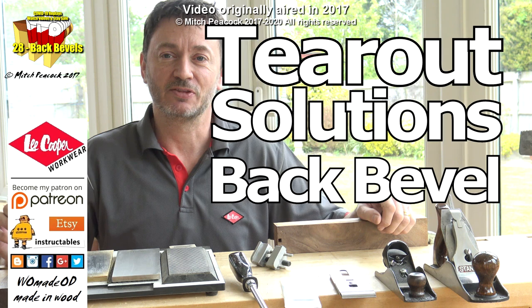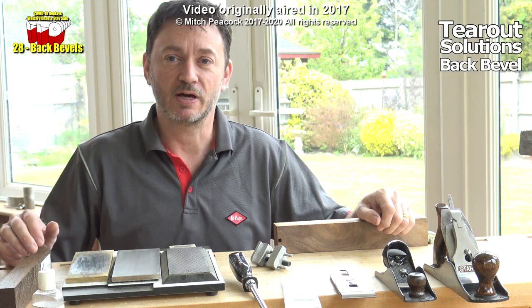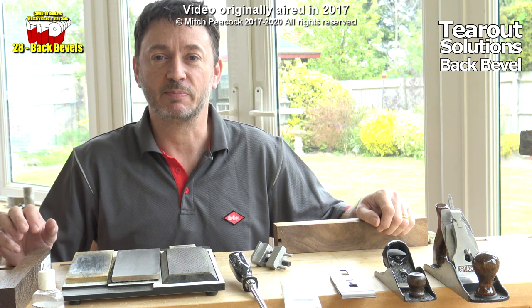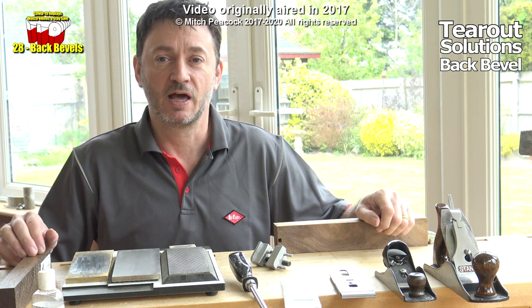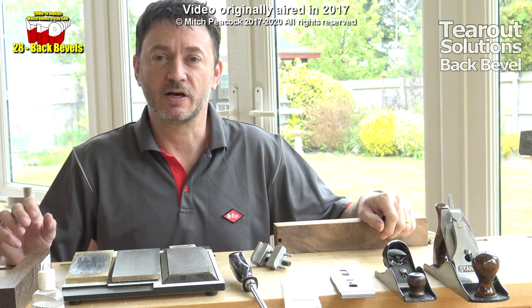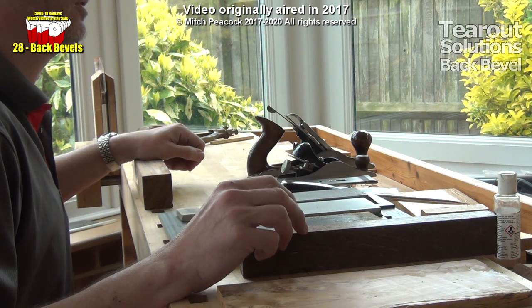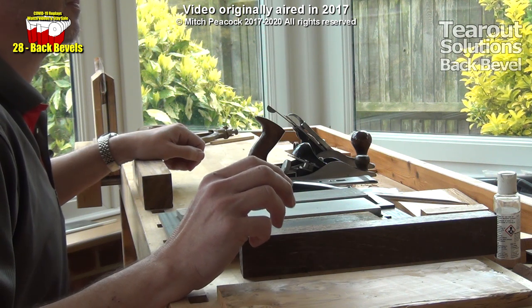Hi, I thought I'd talk a bit about tackling difficult grain today. I've had a lot of feedback from my video about using a bevel up plane for doing this, and you can see that video up here. But today I want to use a Bailey pattern plane with the standard 45 degree pitch frog in it.